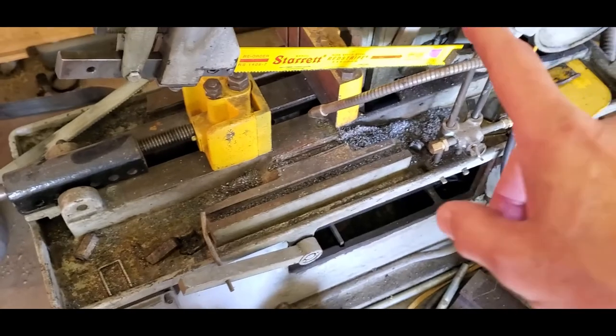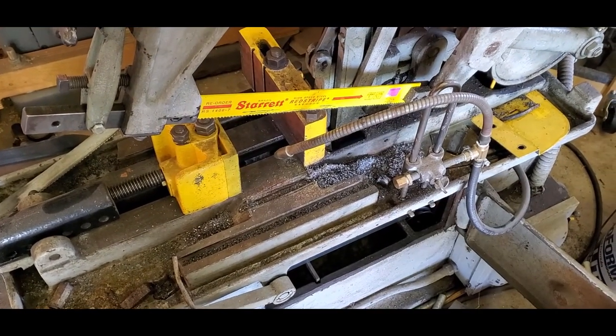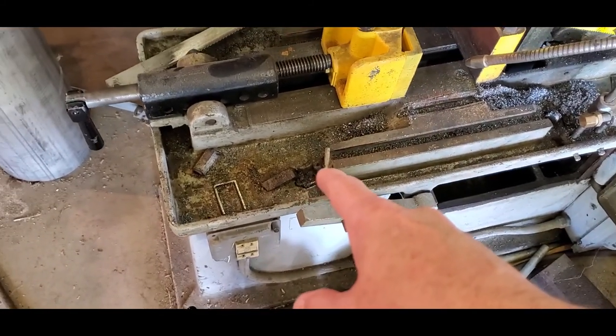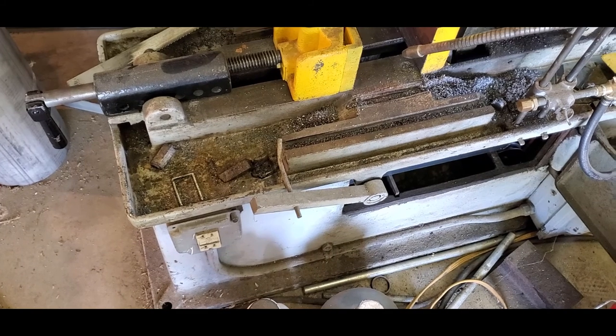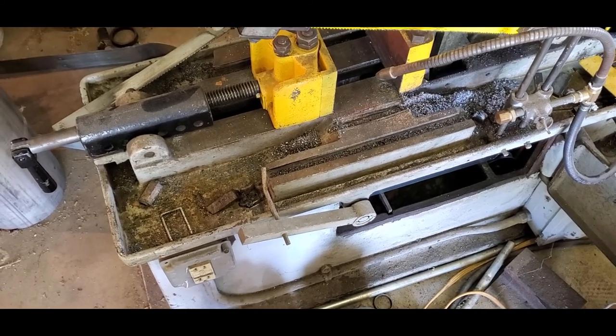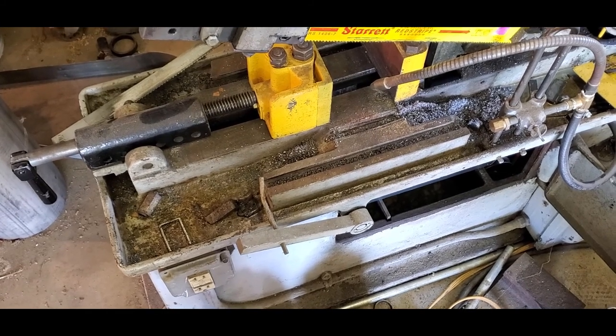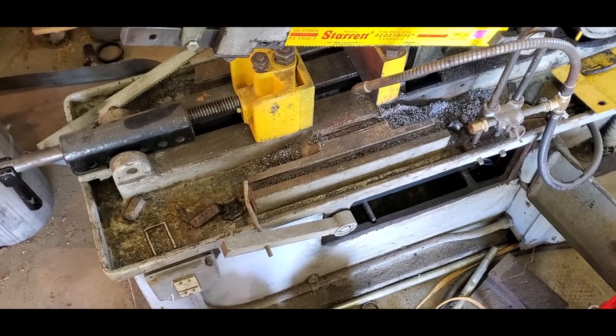And it's time that I take that piece out right there and braze the foot back onto it, which I've never done. Hopefully I can clamp it flat on the welding table, V it out from the top, get it brazed halfway through, and then flip it over, V out the other side, and finish brazing it. And then it'll be strong enough to hold it in place.